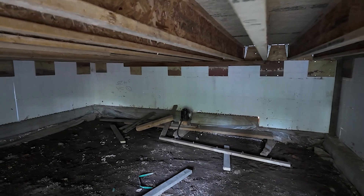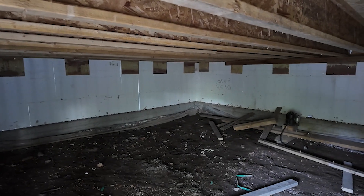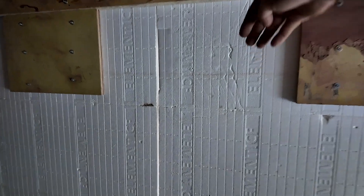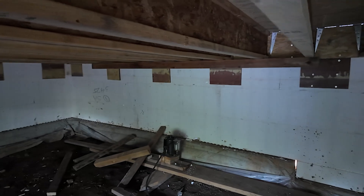If you're doing it with a whole house, you're going to have spans that I-joists can't do, so you're going to have piers. The way we do that is we go ahead and pour our piers when we pour our footings. Then we wrap the ends of all of our beams and we just stick them straight into the ICF. Then we put temporary support running down the wall to the footing. So you've got your entire girder system under the floor basically done, then you put your joists in, you hang it on the wall with ICF screws — quite comfortable to walk on, doesn't feel flimsy. Works out great.